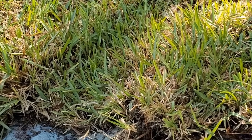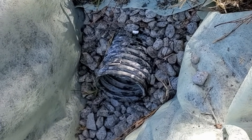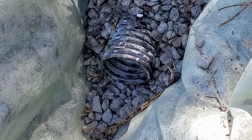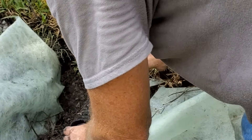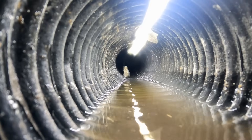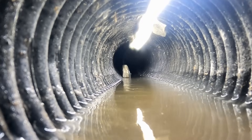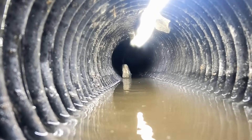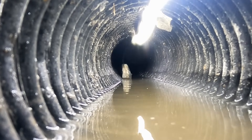We've laid the sod back, and I left a piece of it exposed down here so you can see it. I also have a light inside that slotted corrugated pipe — it's perforated, has slots all the way around it. So let's go ahead and see what happens when we add the rainfall. During a rainfall event, water rises in your trench and it comes through at the bottom of the pipe — that's why there's a base of gravel underneath. As the groundwater rises, it comes through the voids of the gravel, floods up into the pipe, and the pipe carries this away.